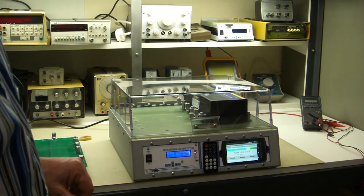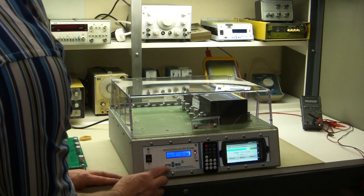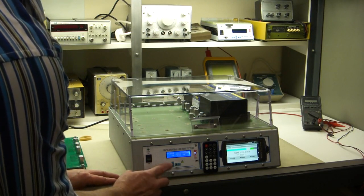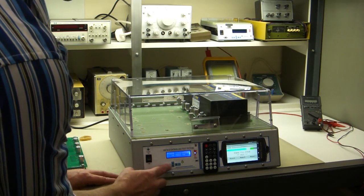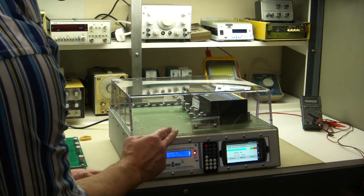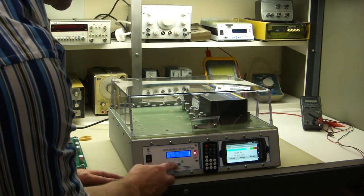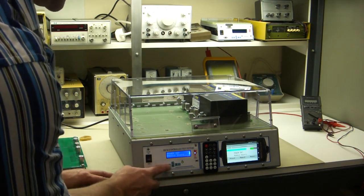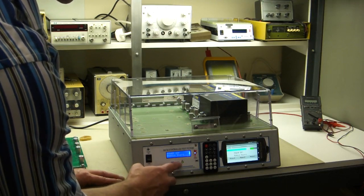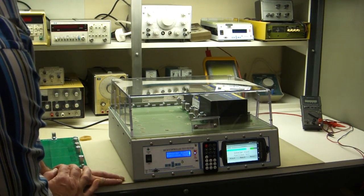Now these buttons here, most of them are for troubleshooting and for setup. So I'm going to go through the basic ones first. This is power on, and it's also a smart test, which tests the last test that failed if a test does fail. So it's good for troubleshooting, and if no test failed, it's just a power on switch. So that just turns power on, and it's not real high voltage power. It's the continuity measuring power. It's 5 volts DC, so it's nothing scary. This turns power off. Okay. So this power on, power off, this is a hardwired reset. It's the only button that can reset. It's a good safety feature. If you have any problems, just hit this reset. It turns power off and sets everything back to reset mode.